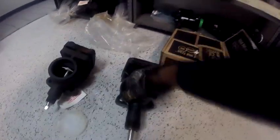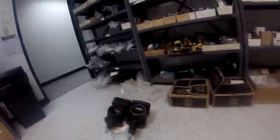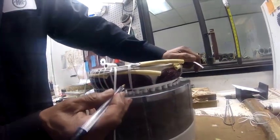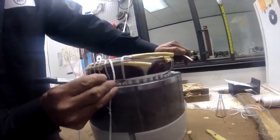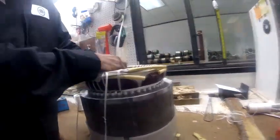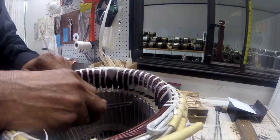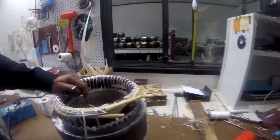Is Justin still here? He's not in today. I wanted to see if he could take me on a tour. You see this paper here? That's called the slot liner. You are checking to see if this wire is touching the chassis. So you are actually testing the slot liner, the top wedge, and if they have protection on the very top — all three. Here is the case. That's what you are actually doing.